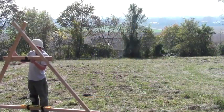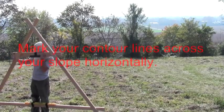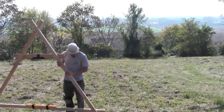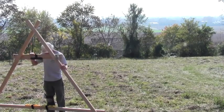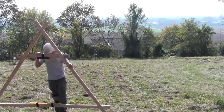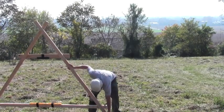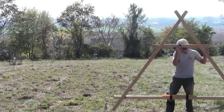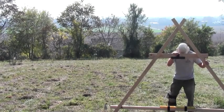I've started my contour line from where I want to put my swale, at the edge of the wood line at the edge of my property. I've marked it with my A-frame level. Basically, I take one foot and put it directly behind the flag I just marked. You want to make sure you keep the flags on the same side of the level, because if they alternate your line will be slightly off. Once I have the one foot marked, I adjust the feet until I get a perfect level reading, and then mark the next flag in the same spot on the back side and move the A-frame again.